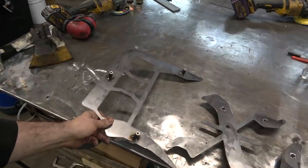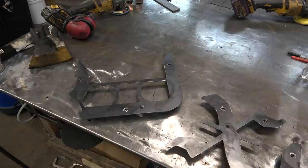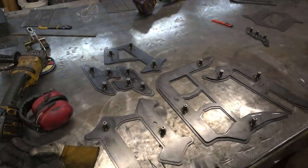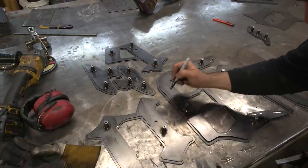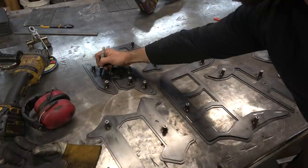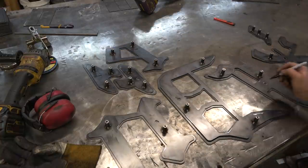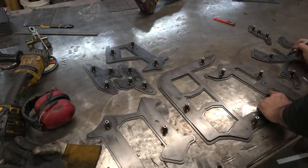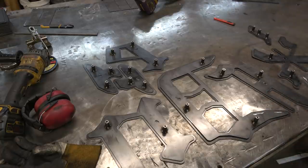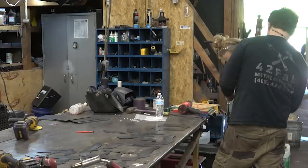We're using the extra or fourth hole in all of the backers, with the backer laying face down, upside down on the face plates, to mark where a stud is gonna go. We're using a stud because this is gonna go for powder coating, and the powder coater needs a way to hang these face plates. You could, of course, just tack a wire on there, but I've got the TrueWeldStudWelding.com TWI 321, and we're gonna run through the first thing that you have to do every time you have someone new using the stud welder.